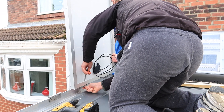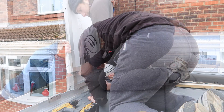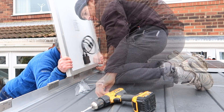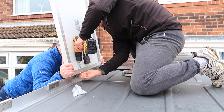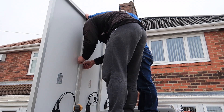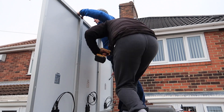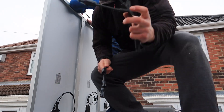Before putting the hinge bracket up on the roof, I held it up against the three clamped solar panels on the floor and marked where the hinges would sit. We pre-drilled the solar panels, then one of us held it while the other fixed the panels onto the hinges using two M6 bolts per hinge — the outer holes were too close to the glass, so we used the two inside holes. Once the three panels were up, we used M8 bolts — one through each centre and one up towards the top — to secure the ends that were still moving slightly.